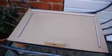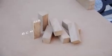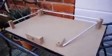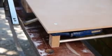Now it's time to work on the handles. I used aluminium tubes for this as I had a few lying around, but wooden dowels should work just as well. Cut down your aluminium tubes or dowel to make two lengths measuring 27cm long and one length measuring 47cm long. Next cut six blocks out of 18mm thick MDF — these need to be around 6cm high and 2cm wide. As they're going to be supports for the handles, you'll need to drill a hole into each for the handles to slot into. Once you're happy with the positioning, drill some pilot holes into the bottom of each support block and a corresponding hole through the back panel. Secure each block in place using some wood glue and a screw — you may want to squeeze the block with a clamp to prevent splitting. Remember to countersink each hole on the front of the panel so that the screws end up flush with the surface. You may also want to glue in the handles to prevent them from twisting.